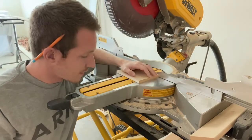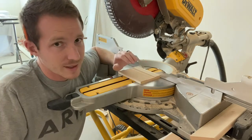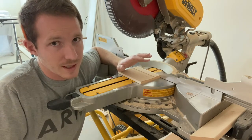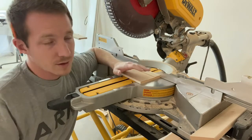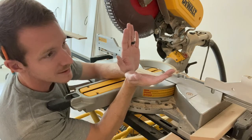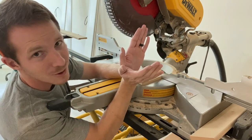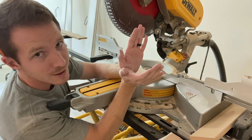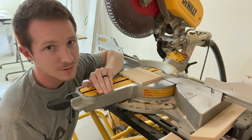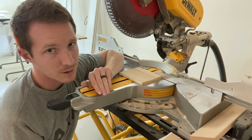You're probably wondering what angle to cut for your jig — you're going to set it at 23 degrees. Here's why: no corner is a perfect 90 degrees. You're going to be a little over 90, which means the angle will be a little open. That's because mudders are a little free with their mud on corners, so finding a perfect 90-degree corner is pretty slim. Going a little wider at 23 degrees is going to be right most of the time — and that's what the protractor is for, so you know exactly what you need for each corner.